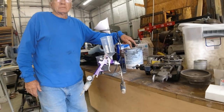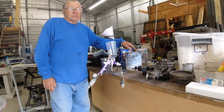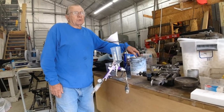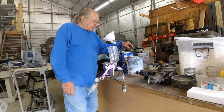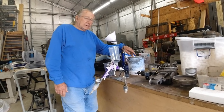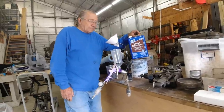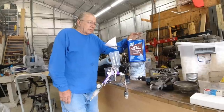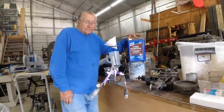Some people ask what color my machines are. It's Gibraltar, from Sherwin-Williams. Sherwin-Williams DTM enamel, Gibraltar. This is oil-based enamel. They don't recommend to thin it, but you have to thin it a little bit if you're going to spray it. It already contains naphtha as a solvent agent in the paint. So I use naphtha just a little bit, just to thin it down just a hair.